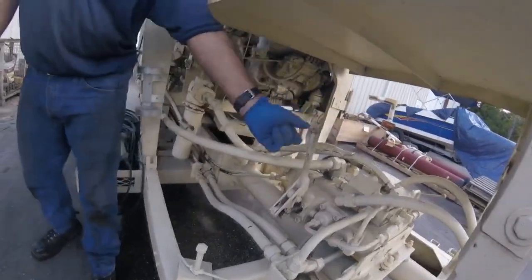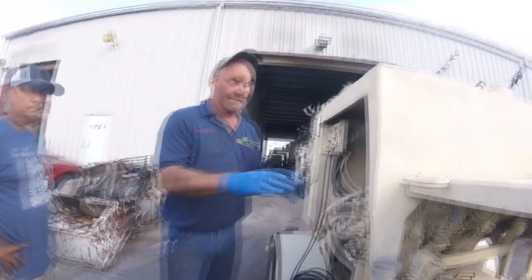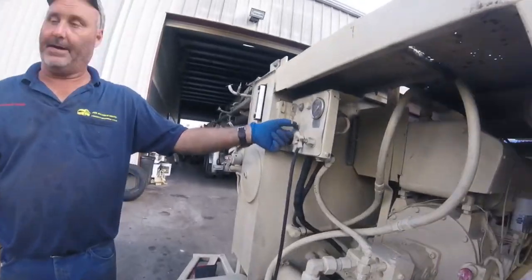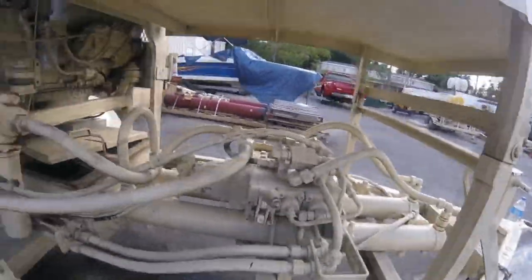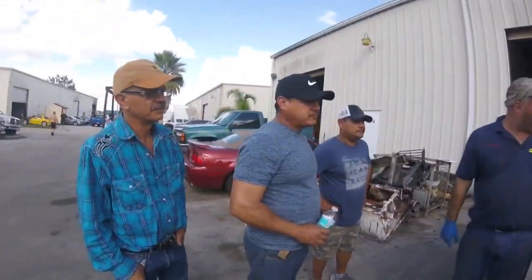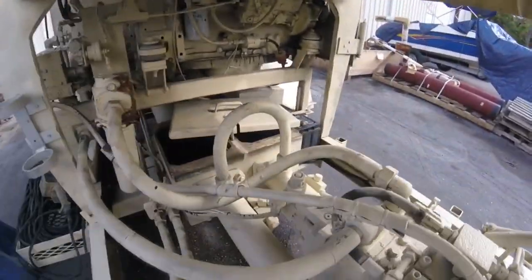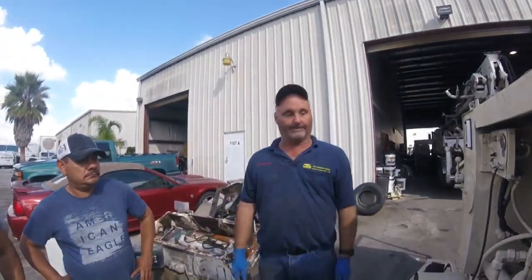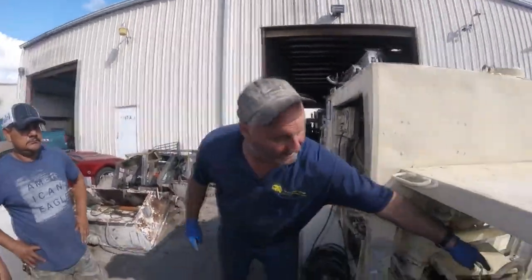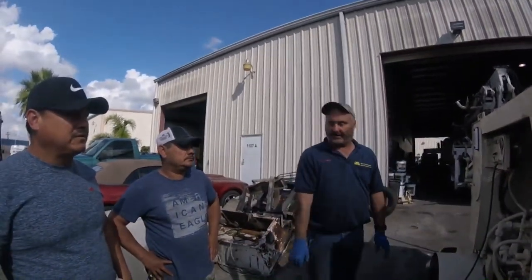Okay, so up in the front here, you got forward and reverse on S1, reverse, neutral, forward, right? So that's a prefix to the on button. You turn it on, whatever function it's in, it's gonna do. If you left it on and you put it in neutral, it's gonna cut it all off. It's just an override. That switch runs this forward reverse valve. That's it. They call it an HOS valve. And manually, you'll see the button here on top. If you lost all power on the engine, alternator, battery, whatever, manually you put it forward and depress that button, it'll start off manually.